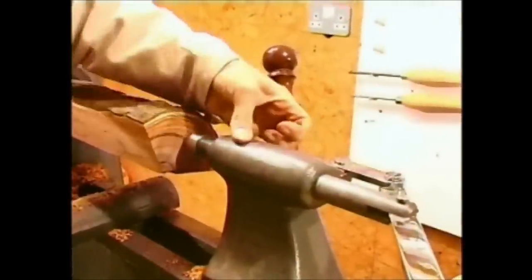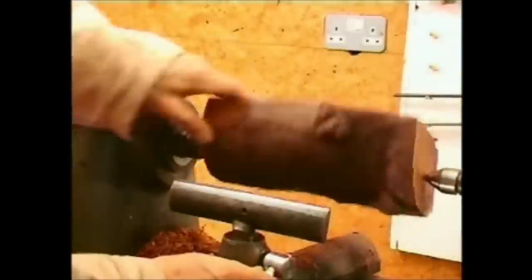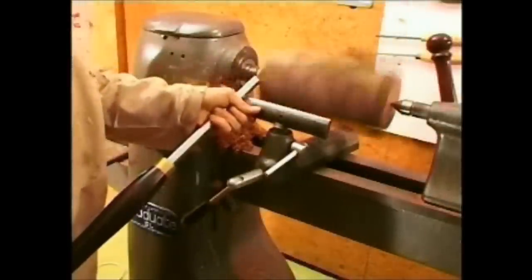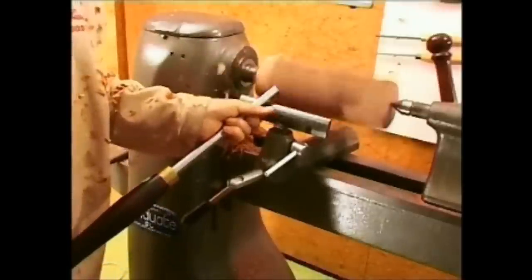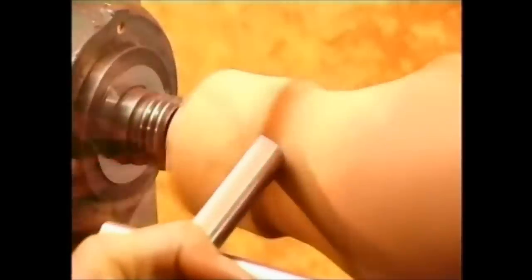Take extra care with the safety precautions before starting a piece like this. Roughly mark on the line you are cutting to. I am using a bowl gouge on this spindle project because it affords me more control. Control of quality and shape, especially on natural exterior work, is far greater with a bowl gouge than with a roughing gouge. The first cuts can be taken at an angle. Wood generally prefers to be cut at 45 degrees. The angle of the tool affects the quality of the cut. Watch how easily the wood streams over the tip if the bevel is in contact both behind and in front of the cut.